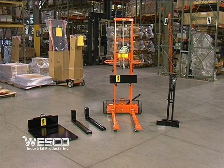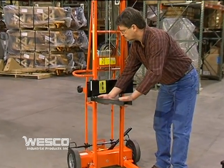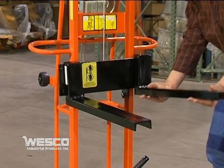The Triple Truck features easy-to-adjust three-position outriggers and allows the use of three different attachments which require no tools to install. The heavy-duty forks can be positioned anywhere along the lifting frame, providing an outside dimension of 6 to 19 and a half inches. These are useful for small pallets and skids.